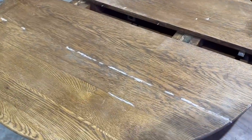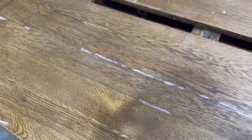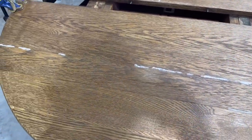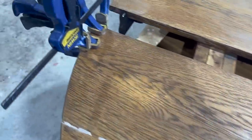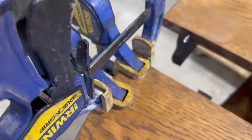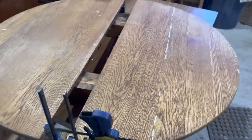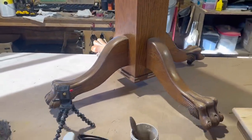Okay, so we've got both sides stripped and steamed, so little dents and nicks that are just compressed wood, we won't have to sand that deep and get most of those out. And I did put a little bit of epoxy putty in our seam because there was a few areas where there was wood missing. So that's sitting there. And then this little corner here was broken, so we've just got a bit of clamps on here, getting that back together.